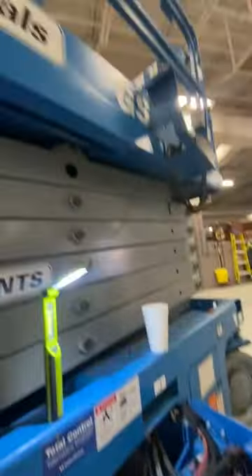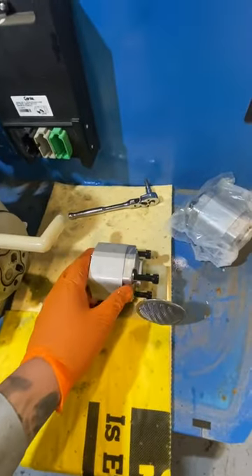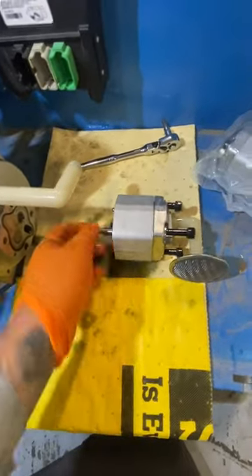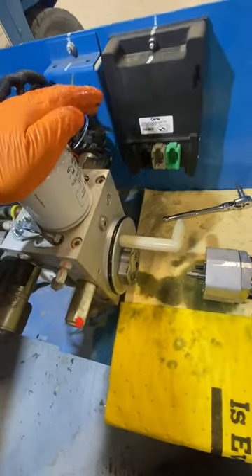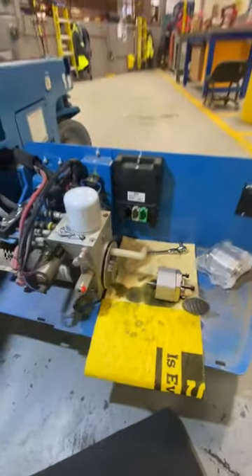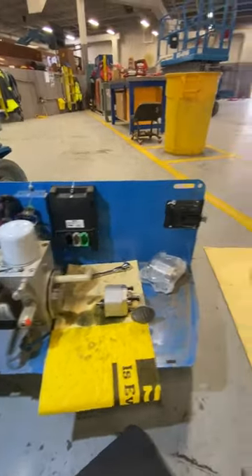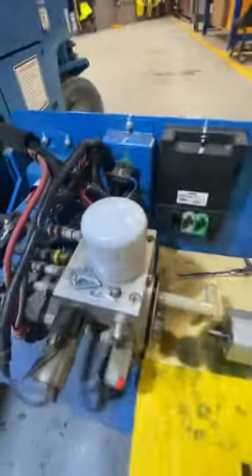For this big 4047 — come on man, we can do better than that. But the pump's been changed out before; this is the second time we changed it out. They didn't change the filter out however, so more than likely there's still shavings in here. When they went ahead and put the new one in, it's just the same recycling. I'm gonna take it to the washer, clean it all up, put it back on.